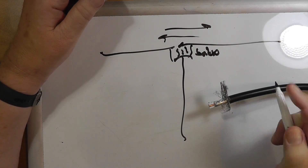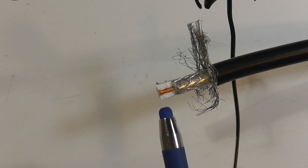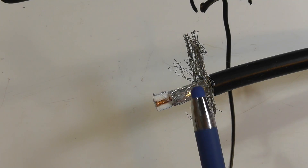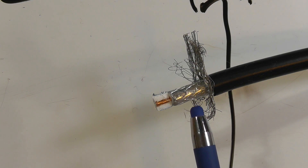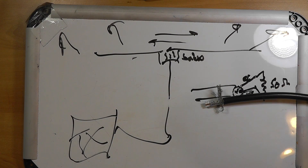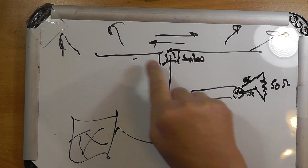The outer shield of the coax — let me zoom in on that. Here's the coax. You can see in this cross section that the outside is completely covered in aluminum, plus it has a tinned copper shield around it. There's insulation, and then a center conductor. This is an unbalanced line — the outside is ground, the inside is the hot. That's what the coax is coming down here, so we have a transmitter with a one-to-one balun because the dipole is balanced.